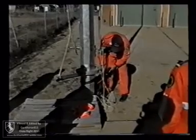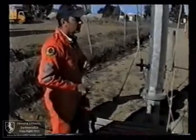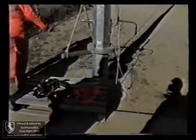Is the weakest point the buckle or the stitching on the buckle? I'd say the stitching on the buckle is probably not, because if you look at the amount of stitching there, there's almost more stitching there than on one of those. So that's just a thought. Try to analyse the system, or train your safety officer, whoever that is, to look for the single point of failure. Now, anchor points. Is this a good anchor point? This pole.